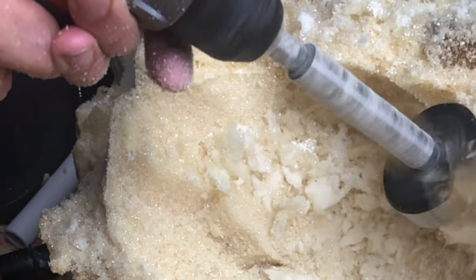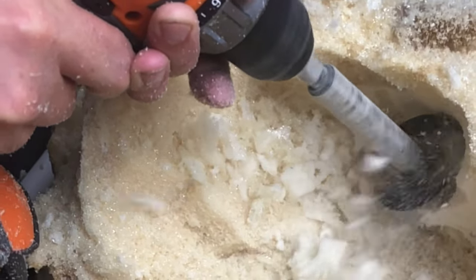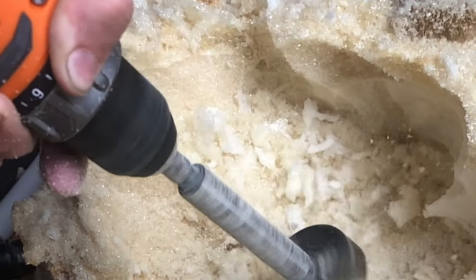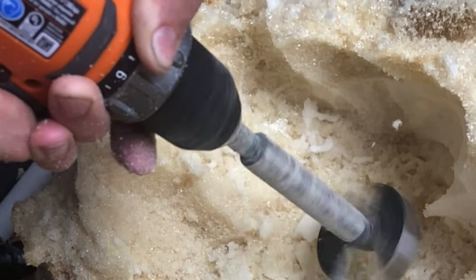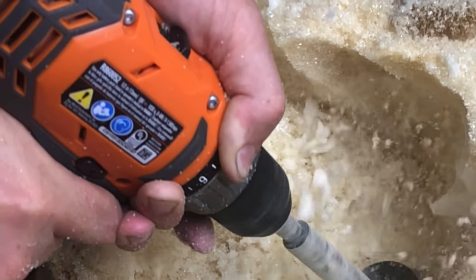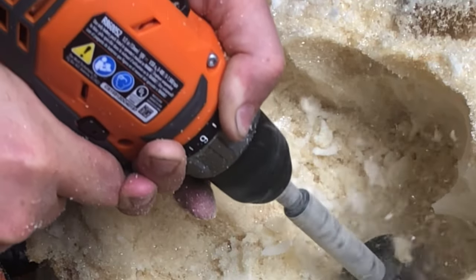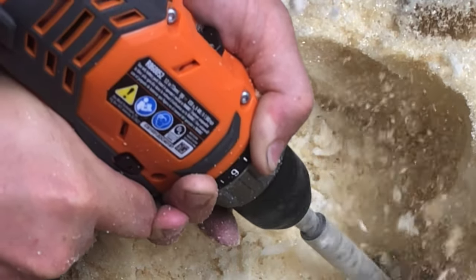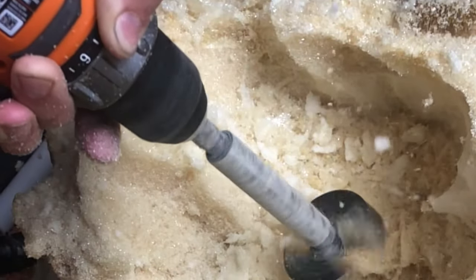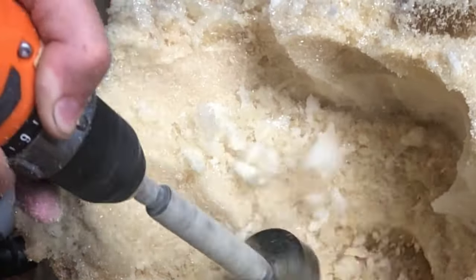What Torrin's doing here is removing foam. This is the hard expanded foam, which is everywhere in Luia — all the cavities, the floor, under the seats, everywhere is this foam stuff. Really hard to get rid of. We've tried various things: cutting it out, using a crowbar, and here Torrin's using one of the messier but more effective methods we found, which was a 2-inch drill bit to grind it up, and then a shop vac to pull it out of the boat. Frustrating, but ultimately effective.